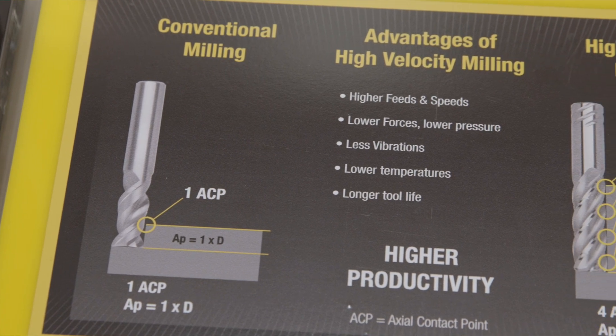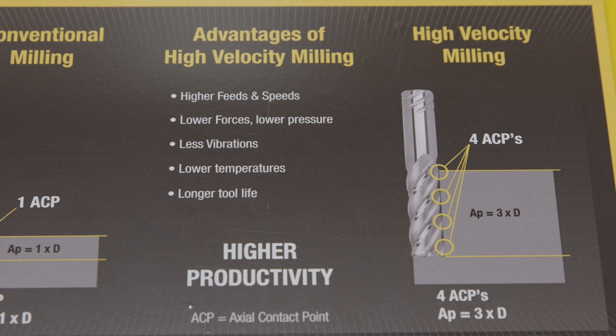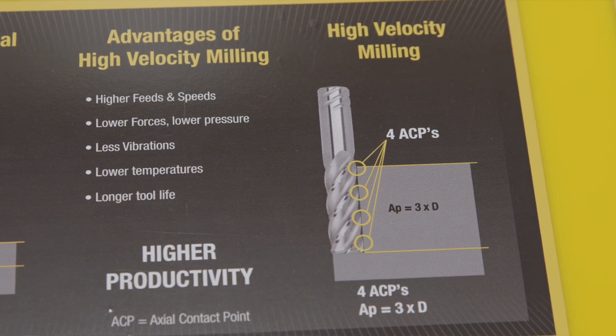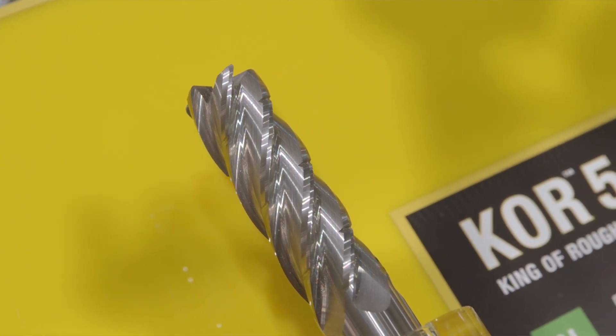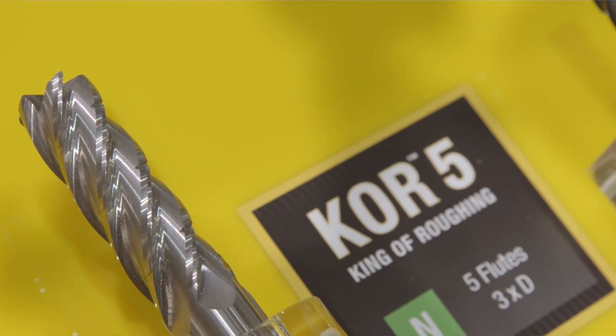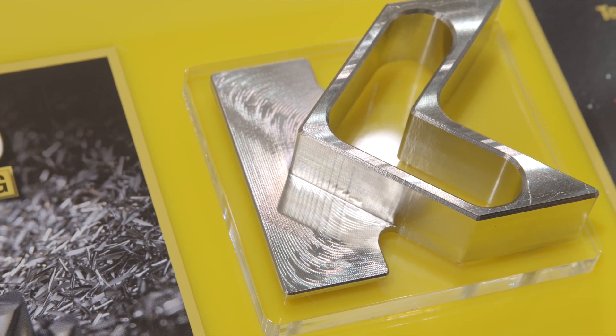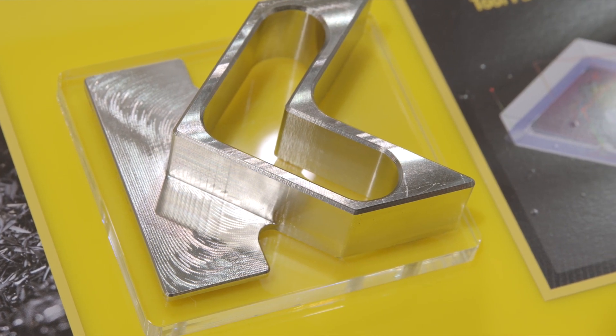So keeping the chip thickness down means you can really push it. The chip breakers make the chips smaller with a defined length, so there's no intertwining or stacking up. You have good chip management with the right chip lengths, and together with the internal coolant it really flushes away the chips, especially in deep pockets or cavities.